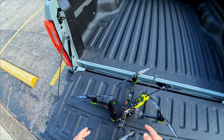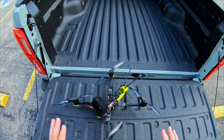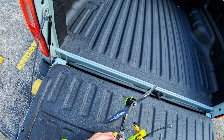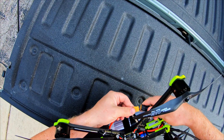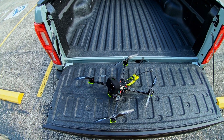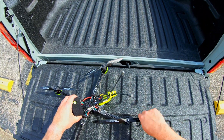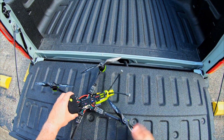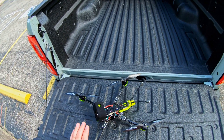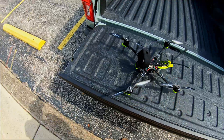It's running ProShot, not DShot, which is a little bit faster than DShot 600. The dynamic braking is just amazing. If you spin the prop it spins like normal, but watch when it's got power to it. So we're booted up now — watch the dynamic braking on this prop. It almost doesn't spin at all. When you're swinging a big prop, the ability for it to stop and start and go up and down in RPM super quick is just going to give this thing absolutely amazing handling.